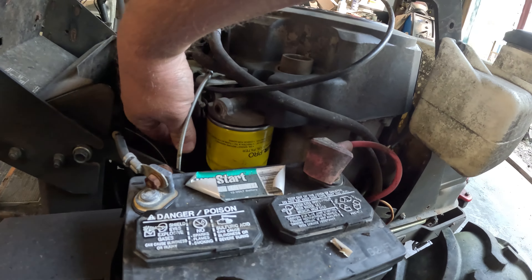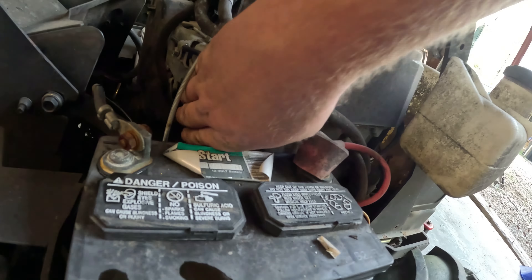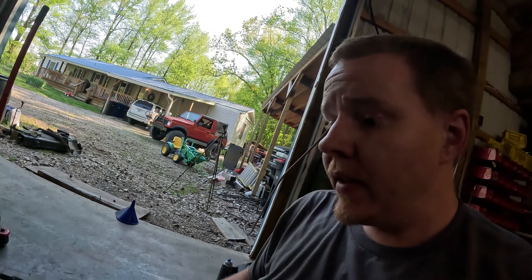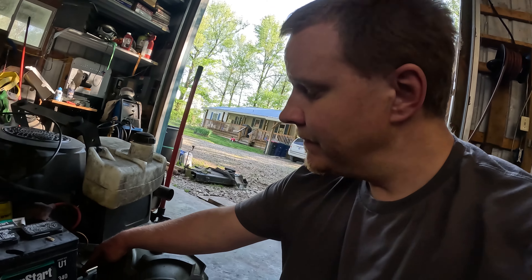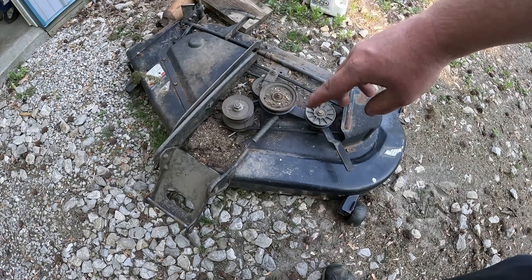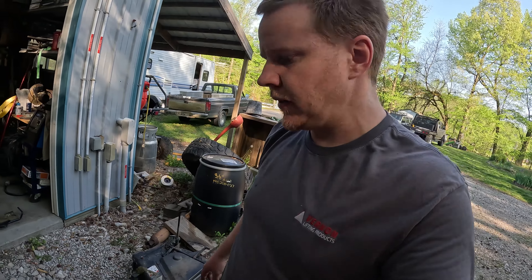The oil's clean now coming out the bottom. I poured just maybe a cup or so of clean oil down the fill hole and let it drain out too. As for oil, I'm just running a cheap 5W30 synthetic — not real critical. I run 5W30 in it and it works, never given me any trouble. I have run thicker stuff in it before — tried 10W40 and 15W40 — but the thicker oil, especially getting into fall and early winter, this thing will not crank over very easy, so the battery's got to be real hot. 5W30 lets it start easy in the winter and in late fall when we're mulching up leaves.